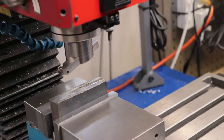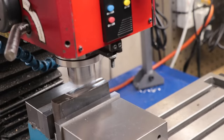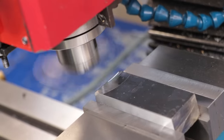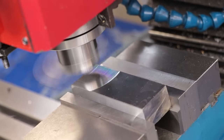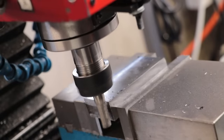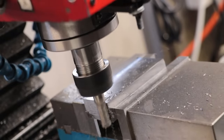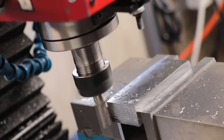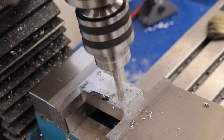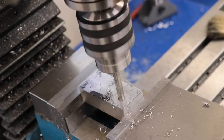So whilst that gets done, I'll start to machine up the selector fork for engaging and disengaging the gearbox. All this really does is move the spline sleeve and hold it in position. So for my design, the selector is going to ride on the rods that connect the motor to the cover plate.